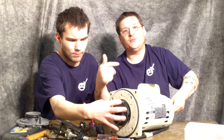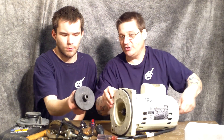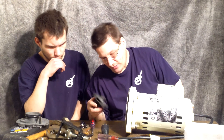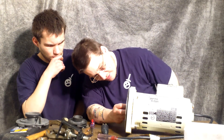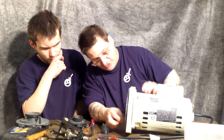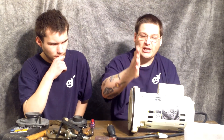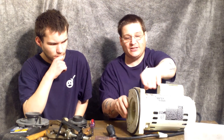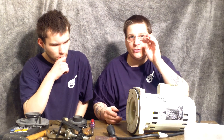The impeller spins off the opposite way of the bolt in the center. The bolt spins to the right; the impeller spins to the left. Now you can see right there — here's one side of the seal that we're going to pull out. There are two parts of the seal inside here: there's one part I just pulled out, and the other part is still in there. In the next video I'm going to remove what they call the seal housing plate, and we're going to show you how to remove the seal, how to put in the new seal, what the kit looks like, and then we're going to start going over the motor.